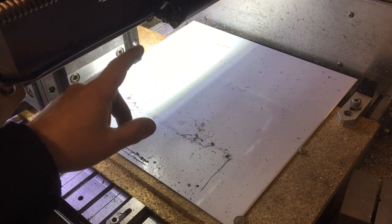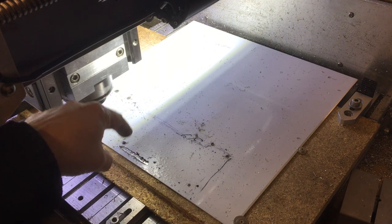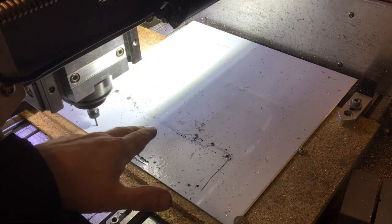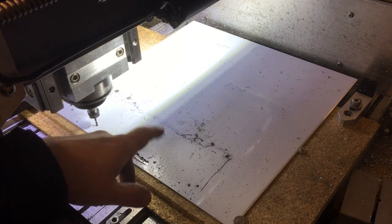We got back again, so we'll load up and put the 6mm cutter back in. And then we'll go again. This time, make sure we've got plenty of coolant. Watch the feed rate as we ramp in. Might even lift the Z a little bit, just so the first skim's not so deep. And then we'll take it from there. Right, let's get going again.